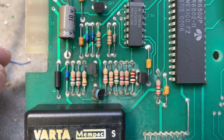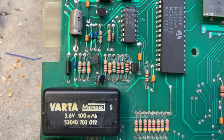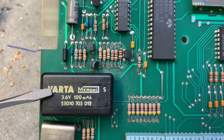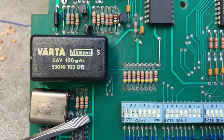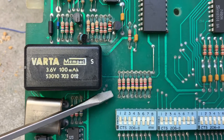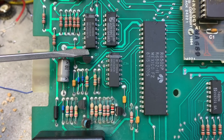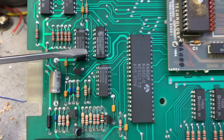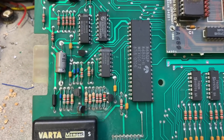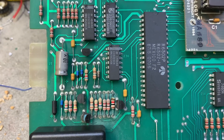Probably the reason is all this corrosion in this reset section. I'm going to first take this diabolical battery off of here and see what's underneath. We've got corrosion down here, so all these parts — these 4.7K resistors — are going to come off. Everything north of this battery all the way up to here, plus that chip, is going to come out and be replaced with a modern reset generator, after I abate the corrosion on the board by sanding it and removing it completely.